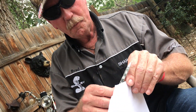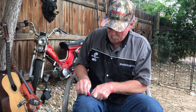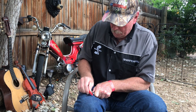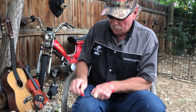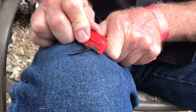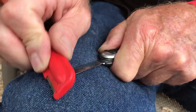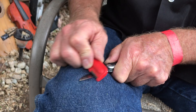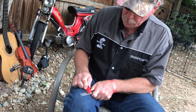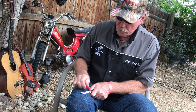That changed tremendously. Okay, that was a big change — I've got to do it one more time. I'm gonna bear down, I'm gonna lean on it and really cut some metal here. Lean on it. Gotta be careful how I lean on it or I'll break the blade off. I'm actually picking it up, moving towards the point, setting it down and dragging it back towards me, so I can rip some metal off. Then I'm going to show you the blade. I talked about railroad tracks on it — and I'm amazed how there's hardly anything on this blade for railroad tracks the way I've been treating it.